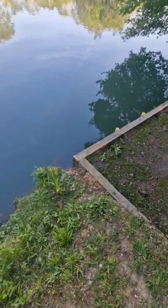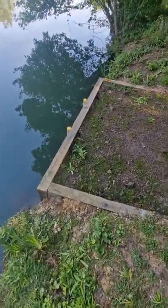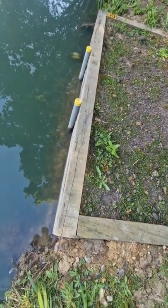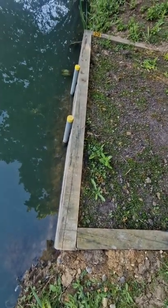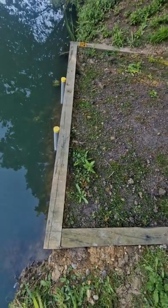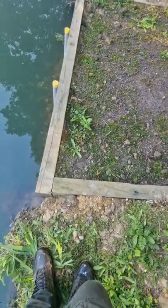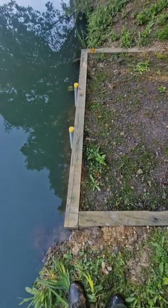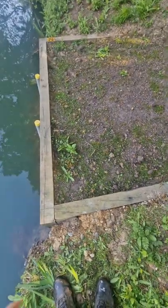You can always add stuff to the tops, but we try and get them as neat as we can. We built these a year ago. You build them on a flat level, make them level obviously, spirit level, etc. Build them on flat clay, put the returns in. That's the bit people don't do. They'll just bodge a bit at the front and then they wonder why it all caves in around the edges.